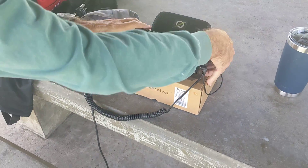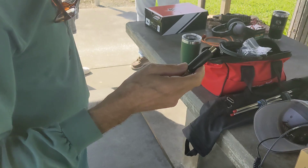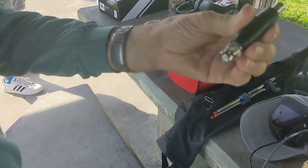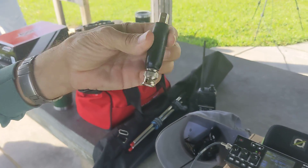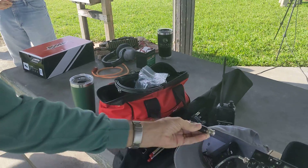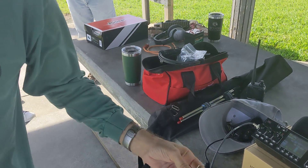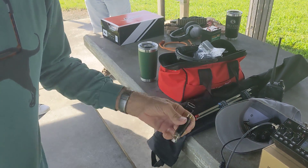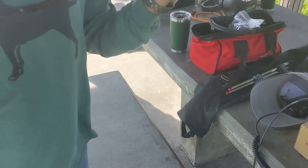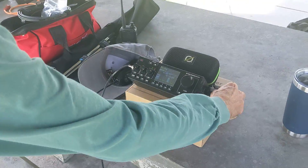This is the latest by Tim. I also have my Tim dipoles in the car. Usually I just string a dipole. This is Tim's one-to-one little un-un. So if you have a problem, you put up a quick little dipole — a homemade dipole or whatever. This is a QRP un-un. You can put it on the table at the radio if you want to use part of the coax as a counterpoise, or put it at the antenna to even up the polarities on both sides of your dipole. Un-un means unbalanced to unbalanced.